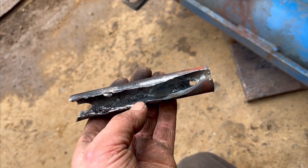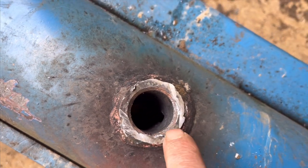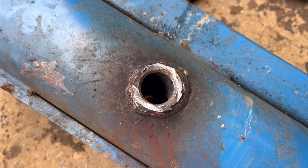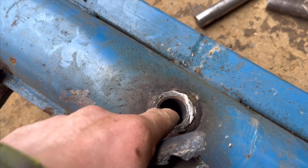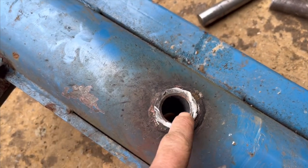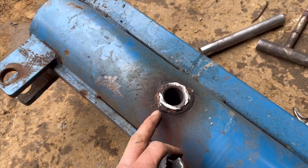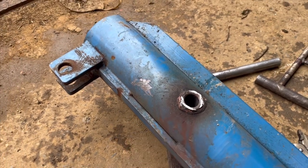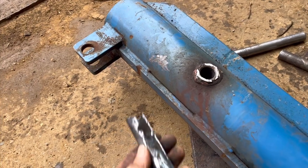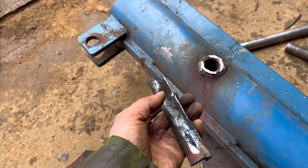I've got the pin out — there's not much left of it. Trouble is, you can see it's burnt through the side of the bush. That's the trouble with small diameter pins — if you wander off slightly you end up burning through the side and through the bush, which is no great problem. It won't take me long to nip them welds off, five minutes to nip them welds off, twenty minutes in the lathe to make a new bush to go through the centre and let it back in. But yeah, it was worth a try getting it out.